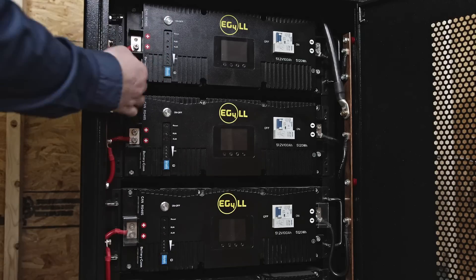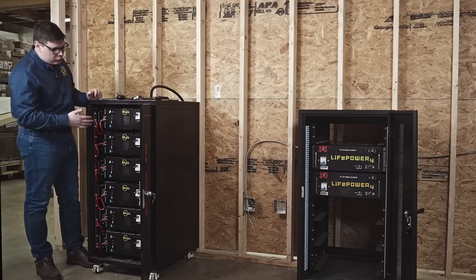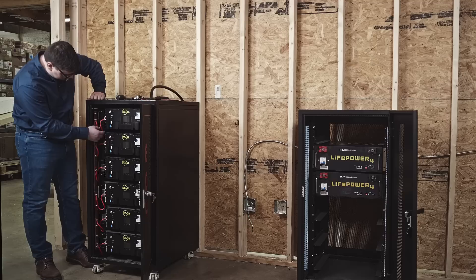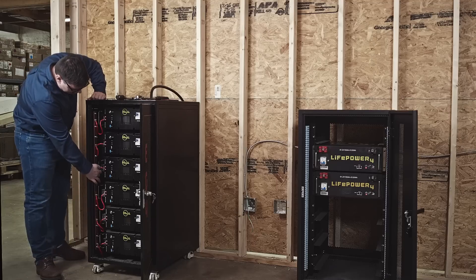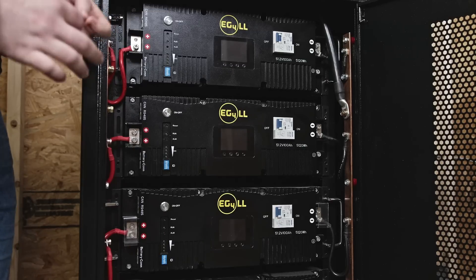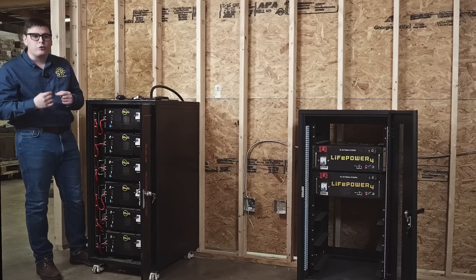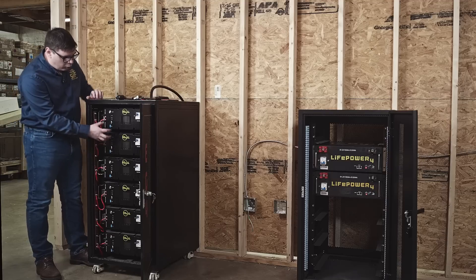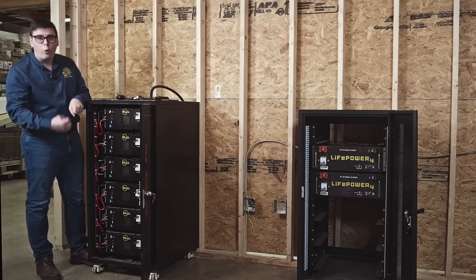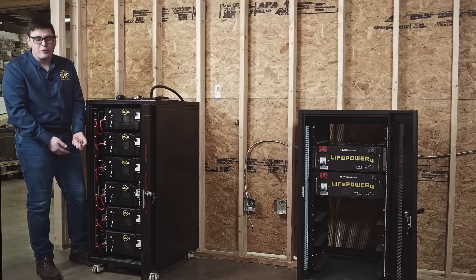With the LL V2, the handle is a tight fit — it can lay flat but will come very close to the bus bar. If you install this in the cabinet with the handle still on, you'll have to place the wire between the handle and the bus bar. We don't recommend using the handles at all when installing in this cabinet, because the handles actually cover up the mounting holes. The mounting holes are directly behind the V2 handles.